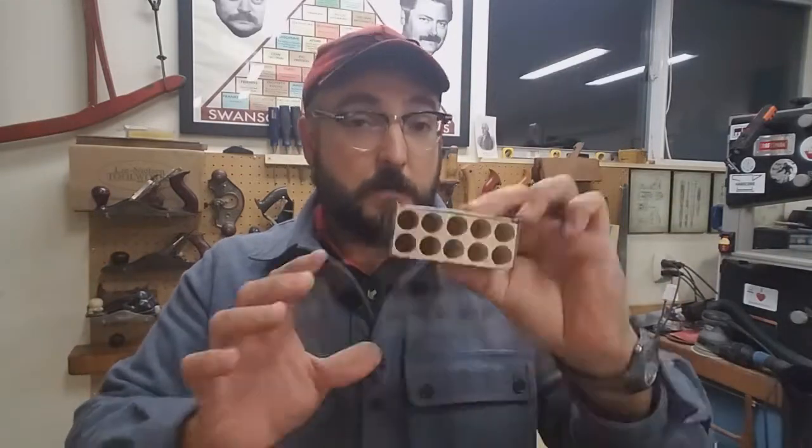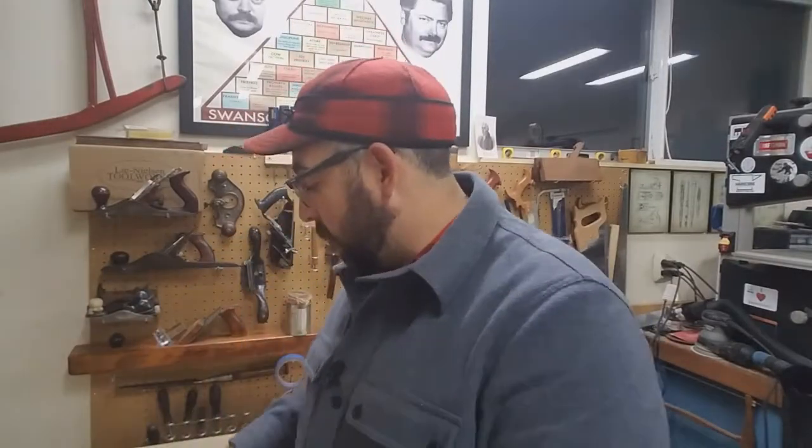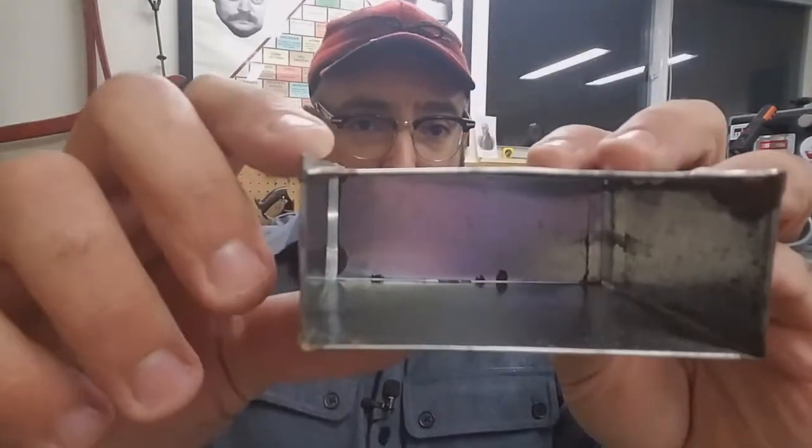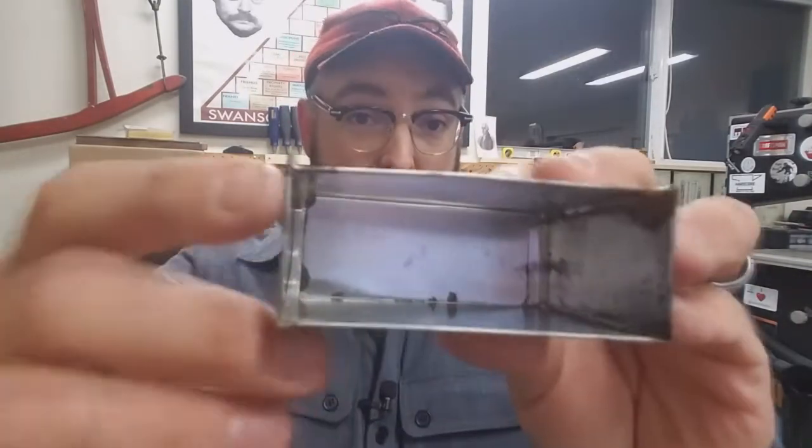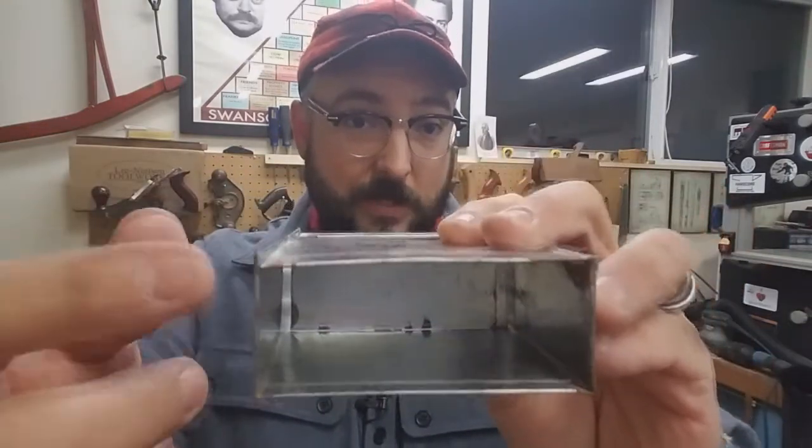It's really important that if you're going to be making more of these, obviously you have to make the matching one. If you're going to be making more of these, it's going to be really worth your time to get handy with that soldering gun so you can fix errors like this in the cartridge tin construction, and get at least that inch and a quarter of the original block insert thickness — it's going to save you a lot of stress in the long run. I have made them to fit a reduced size just out of speed and necessity, and it's hit and miss — you're going to have a high likelihood of blowout. It may still work; it just won't look as pretty.